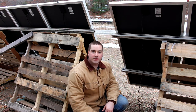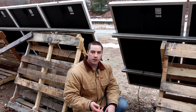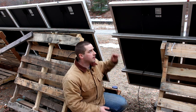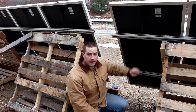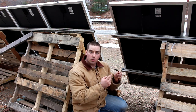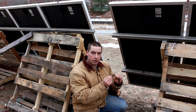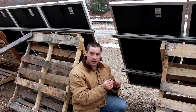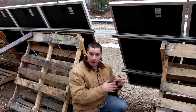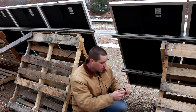Last step is the wiring. I'm going to series string all these together, which means I want to go positive to negative, positive to negative. These old panels are different than the ones you would buy today — they actually have a positive on one side and a negative down at the bottom, with short leads and an older non-locking MC connector. This would not be correct if you were going to try to do a grid-tie system — you would need a locking connector today — but I'm just doing this as a temporary fun off-grid little setup, so I'm okay.